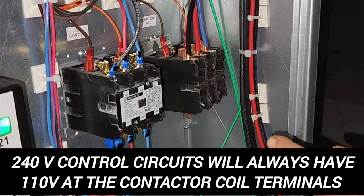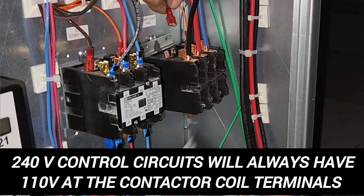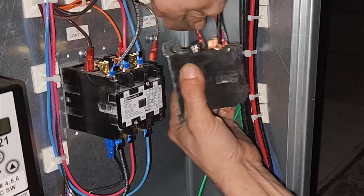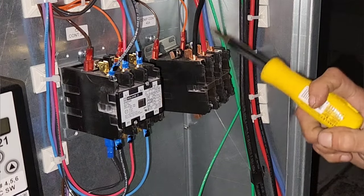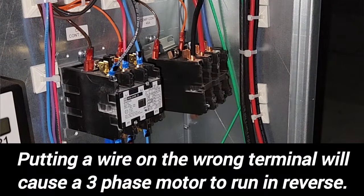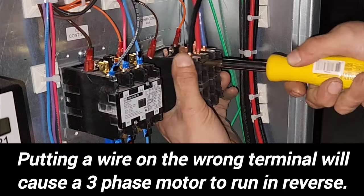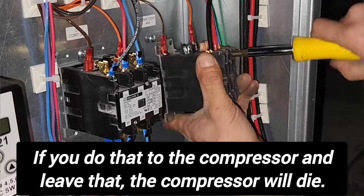Now that's control power. I'm gonna go ahead and shut these off. Yeah, because I don't want to get bit by 110 or whatever. Might be something there. It would bite me. Now in this case, this is color coded black, red, blue from left to right. So I can loosen this contactor completely, all three wires at the same time, and be good. Good to go.